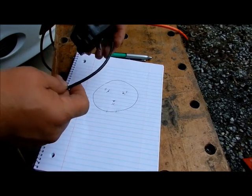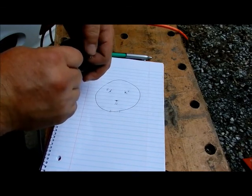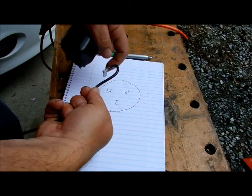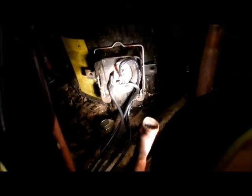So we could figure, okay, it's coming around here. It's going to be on this side. It's coming around here, so we're going to bend it, and that's going to be how it's going to sit in. Okay, once again, I made sure the breaker inside is off, and I pulled the fuse box out of the panel outside. Okay, this is what I did and how I arranged everything. So yellow, I looked at yellow and red and black and put them on exactly the way I got them off. All right, and that's why it's so important to take pictures.